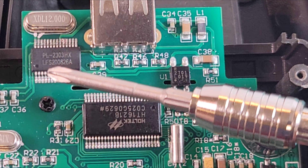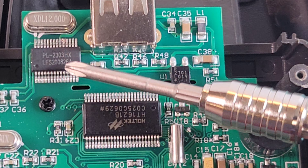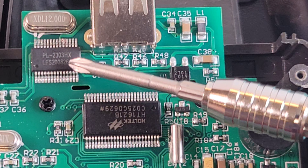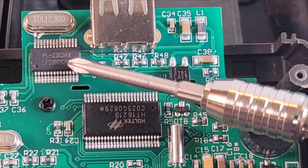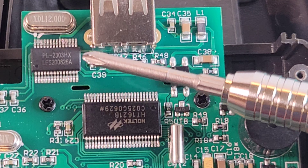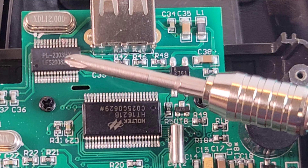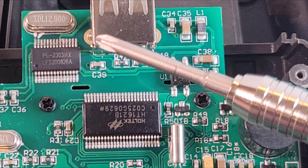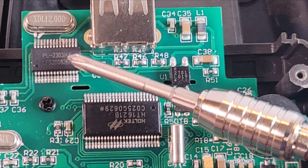The USB port is not optically isolated — we're talking 2014 hardware. The USB-to-serial bridge controller is the PL2303HX, fabricated March 2013, with built-in Windows 7 and Windows 8 driver support. That's a problem because most people today are running Windows 10 or Windows 11, so you may run into compatibility issues and might have to go into compatibility mode when installing the software.